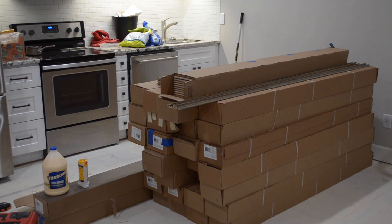Before we get started with laying down the flooring, we let the wood sit in our basement for about a week to let the wood acclimate to the temperature and moisture of the area. This is important because it allows the wood to get used to its new environment, which prevents excess expansion and contraction once installed.